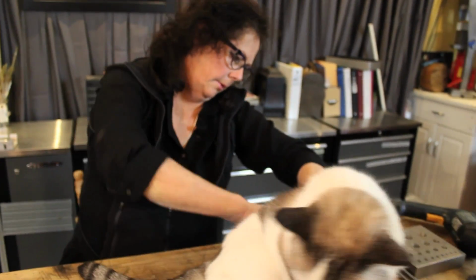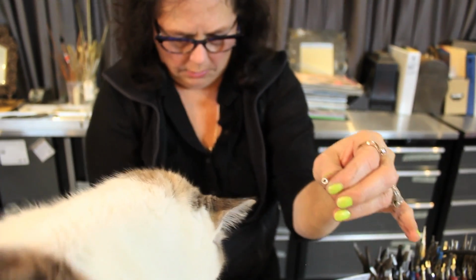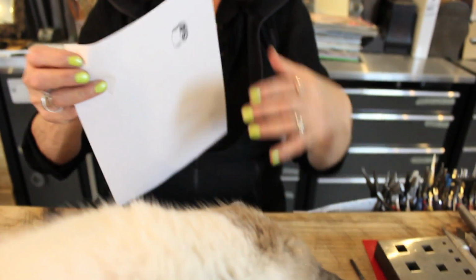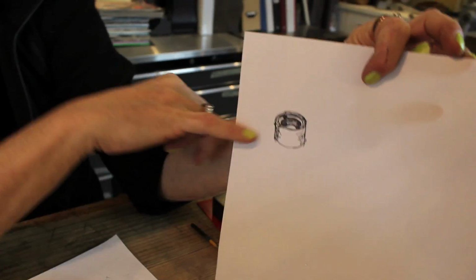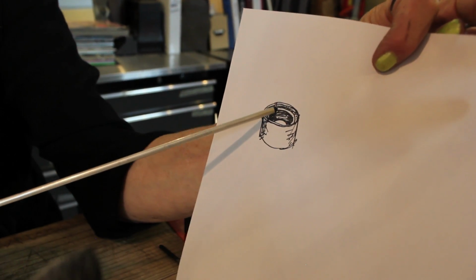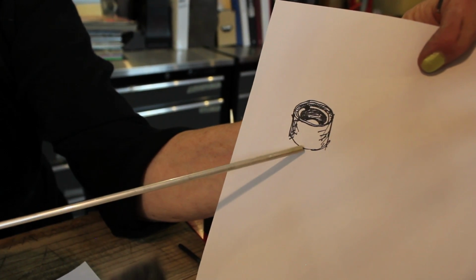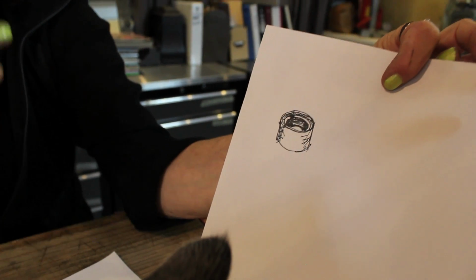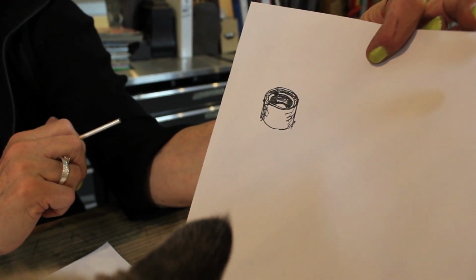Okay, so now once we've cut these things to size, you're just going to put your tubing together, and I drew a little picture of how the solder goes. You're going to solder the two tubes together, and here's my fabulous drawing. And there's your solder. I like to ball it up for these situations. The solder would sit on the top of the inner tubing in here. Then I also flip it over and put solder on the back. The concept is to draw the solder through the tubing on all sides so that it's really in there and it's fully soldered.